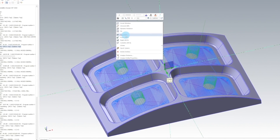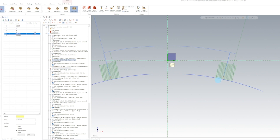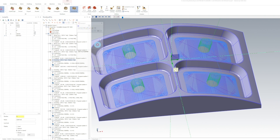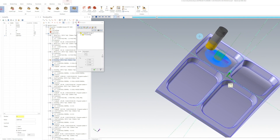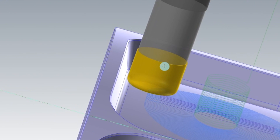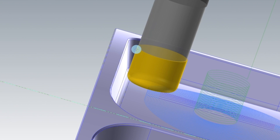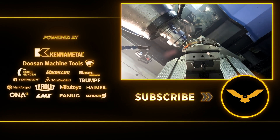You can notice that it's following the curved floor. Turn our model and curves off — you can see it following that curved floor, helical milling down to the bottom of the pocket. If we run a back plot on this, you can see in the corners that this toolpath stays normal — or perpendicular — to the floor. So now all we're going to have left is this little material from the end mill to the tapered wall, and we're going to get rid of that in the next video using a swarf toolpath.